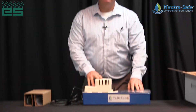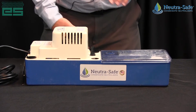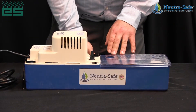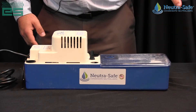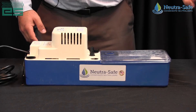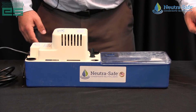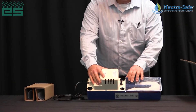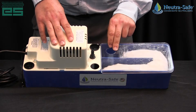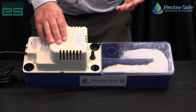Put it on the ground, install it, and you're ready to rock and roll. Some of the features and benefits: we have a low profile unit, so it's easy for drainage from the outlet of a high efficient furnace, boiler, or water heater that has a low profile port to get rid of acidic condensate. We have a dedicated port for the acidic product, as well as three separate ports for non-acidic products, so you're not neutralizing anything that doesn't need it.